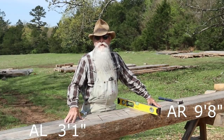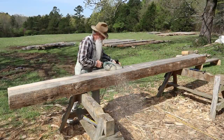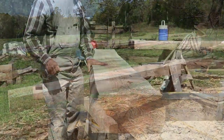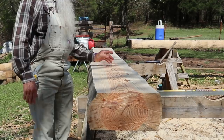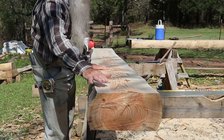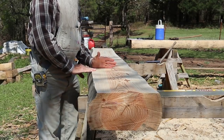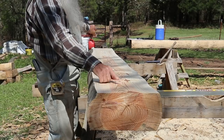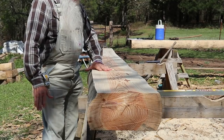I'm going to work these two separate pieces in one log, but I'm going to be using two separate center lines. I'll go ahead and get this log planed. If you look down this log, it's got a slight crown on the top side of it — I always put the crowns up. I'll snap two separate center lines on this log so I can take this shorter piece and work it with the bulk of the whole log. Since I have a crown here, if I had just snapped from my shoulder on that left log to the shoulder of the right log up there, my center line would be off and it would look like this log was tilted up coming up against the doorway.